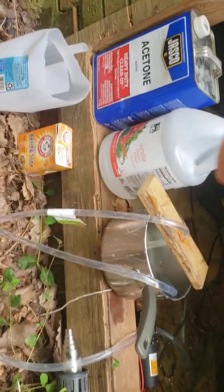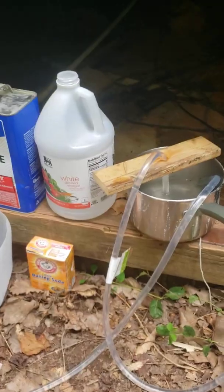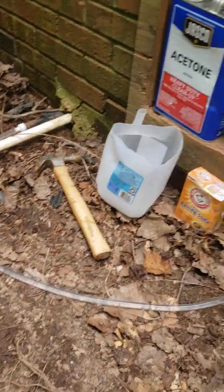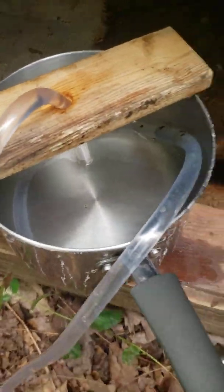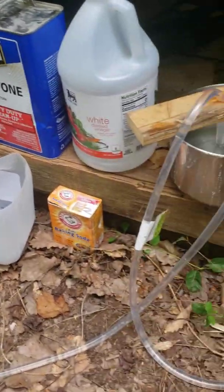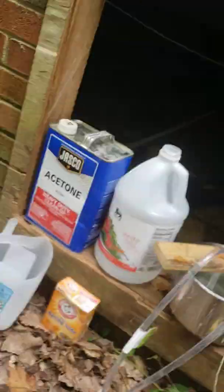Those flush kits are really expensive, and I remember as a kid cleaning copper pennies with vinegar and salt. So what I did is I rigged up a loop, and I made like a vortex filter, so this vinegar and salt solution is just running through the line set.